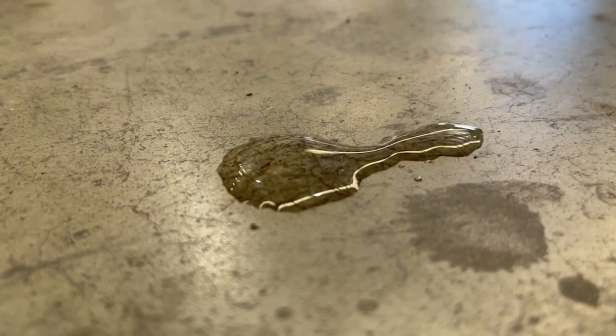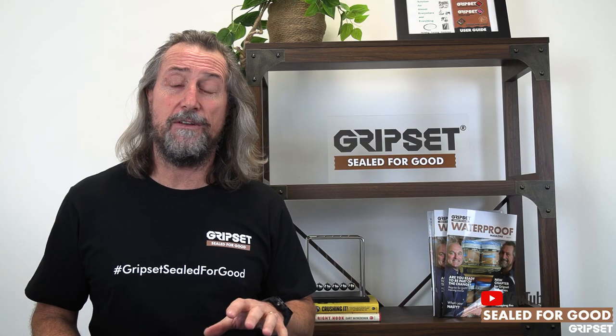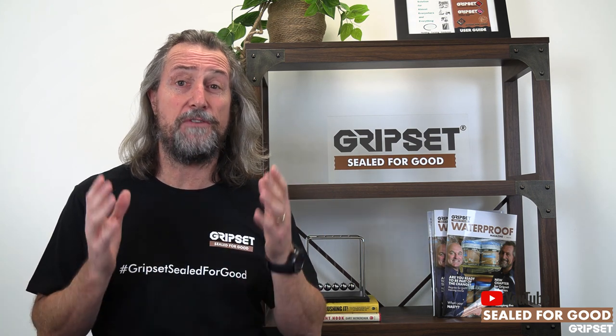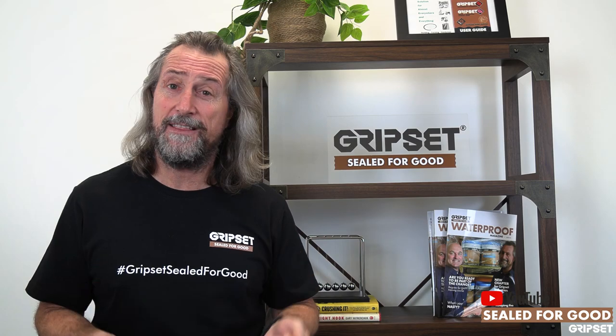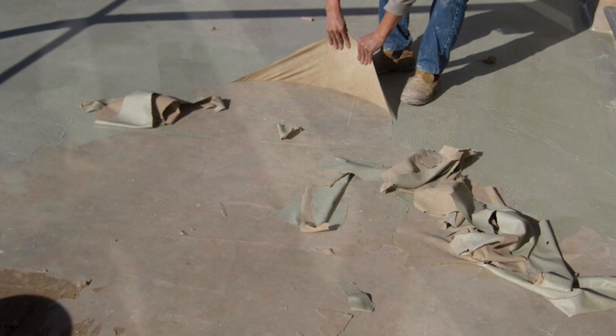If the water is beading and not absorbing into the concrete as quickly as it should be, then you know there must be something there to prevent that. That's going to require surface preparation work — whether it be grinding, pressure cleaning, or blasting. Speak to the builder and understand what's happening, because you might be there months after the concrete's been laid and need to know what has been impacting adhesion. If you can't adhere to concrete, I've seen the best membranes — liquids or sheets — just peel up easily. But once you've prepared concrete well, it's a real simple one to waterproof.